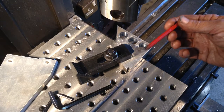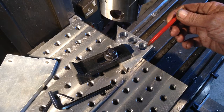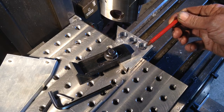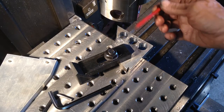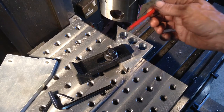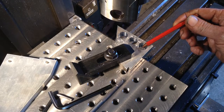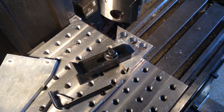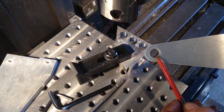So I've got a similar material. My first hole I use to get the boring bar on size, and then I'll push the boring bar through 2 more holes to make sure it's repeating correctly. Now, I did pre-drill these holes to 15mm, as is the size of the hole in the part. These have been water jet cut to 15mm.